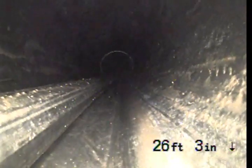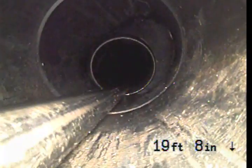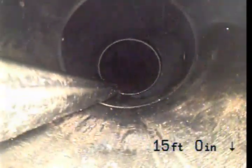The tree has penetrated the sewer line. The ABS plastic piping — all of this is underneath the home. We're coming back in reverse. When we come out, we'll show you a landmark like the decking patio area here. The sewer line is wide open. Recommendation is a spot repair and possibly an epoxy liner to the center of the street. I'd like to review it one more time. Thanks for having me.